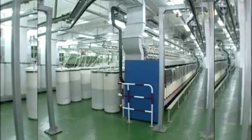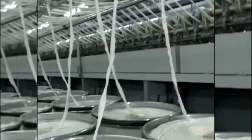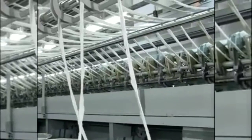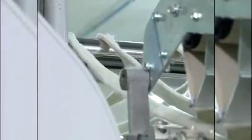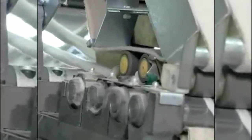The purpose of the roving operation is to reduce the sliver to a suitable size for spinning. The drawn slivers are pulled over the creel and entered into the drafting system. The simple drafting system consists of three pairs of rollers running at increasing speeds.